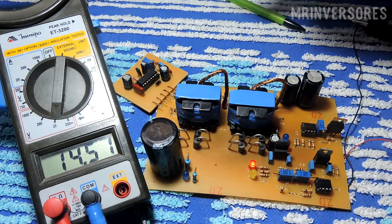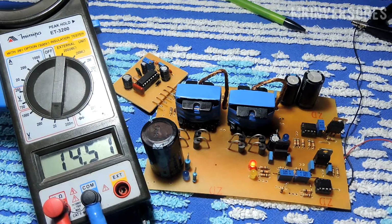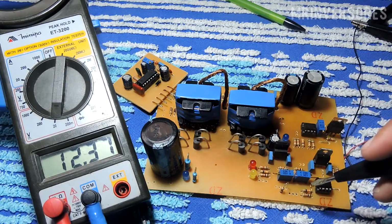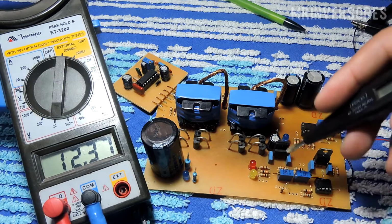Then it turns off the converter, then we'll test the low voltage here. Let's say the battery drops, you've been using your inverter for a long time and the battery voltage starts to drop, so let's put the minimum I set here. I set it here to turn off the converter at more or less 11.2, but in reality I'm going to leave it at 10.8. I left it at 11.2 because the minimum of my supply is 11.1 volts, so for me to be able to show this to you, I had to leave 11.2, so that when it goes below 11.1 it cuts, okay?